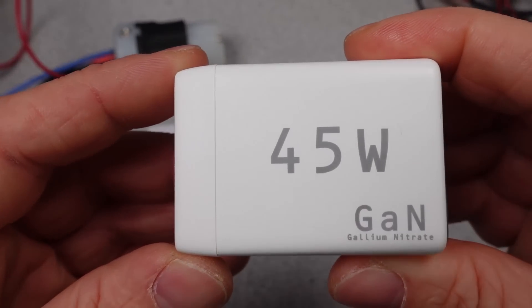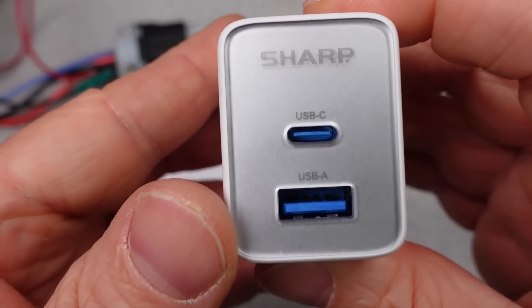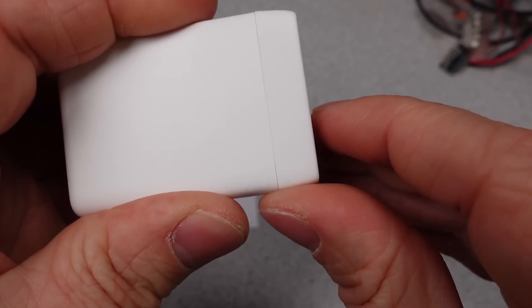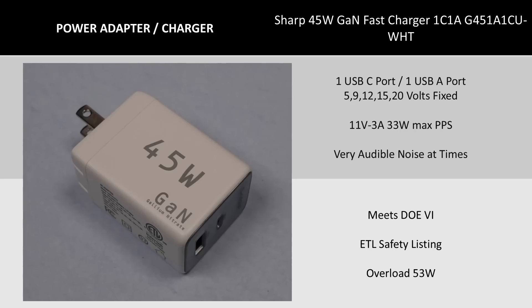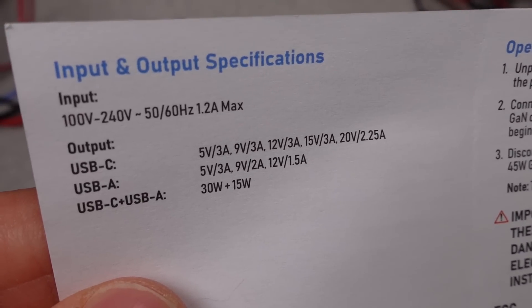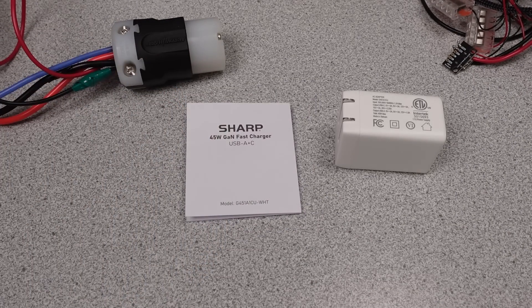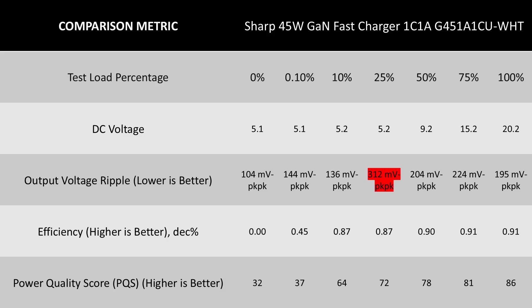The 45 watt adapter is next. This goes back to the USB-A and C port. It does uneven power sharing again. The adapter has PPS, or Programmable Power Supply modes. Actually, these all have PPS modes, and none of the documentation even mentions that. The USB-C port does have a renegotiation when plugging into the USB-A port, and these all also do that. This one made quite a lot of noise in various modes as well, so something to think about. That audible noise is usually a deal breaker for a lot of people. The performance showed some instability in the DC output voltage — the ripple was measurably a bit higher in some modes.